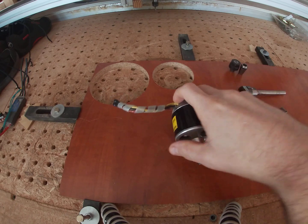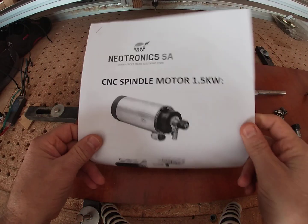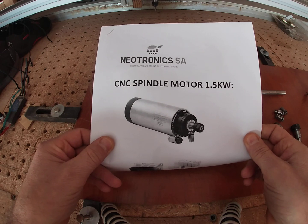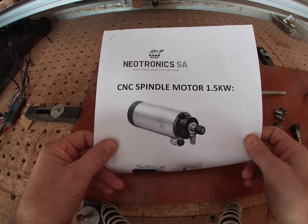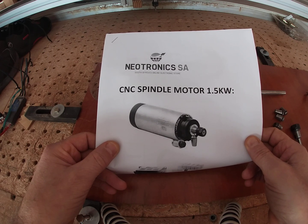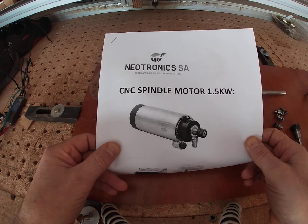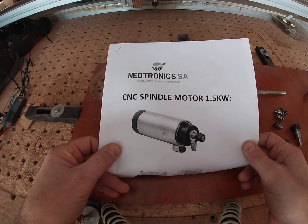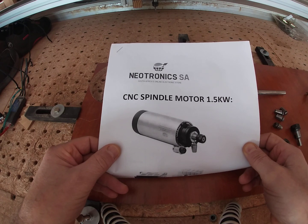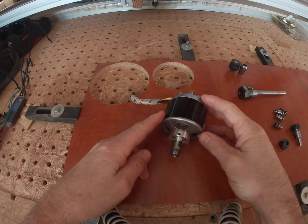Eventually I abandoned all of that and bought myself a CNC spindle motor — 1.5kW, air-cooled. It has just so much power, runs quieter than the brushless motor, and it was not cheap. With the VFD module and the motor together I paid about 11,000 South African rands, but it was the best upgrade for this machine I ever did. If you've got the money I would say install this directly; if not, the brushless motor is a cheaper option while you save up for the upgrade.